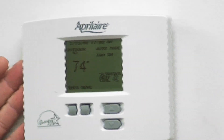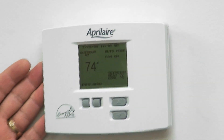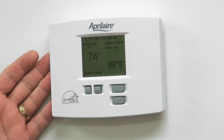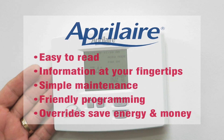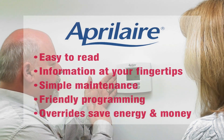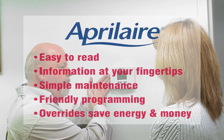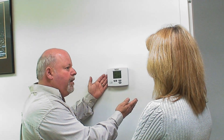This will also save you on energy. Now that this thing is not looking for any electric backup heat, your utility bill cost is just going to be a lot lower. They're going to be using the heat pump, not the electric heat. Or if you had a fossil fuel kit application with gas, it would do the same thing — lock that out and let the heat pump do most of the heating without using any of your backup source of heat at all.